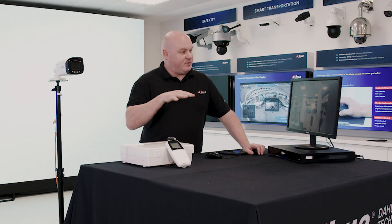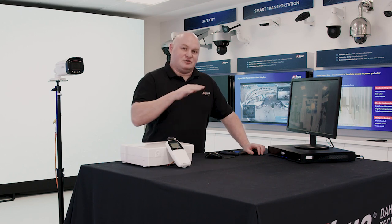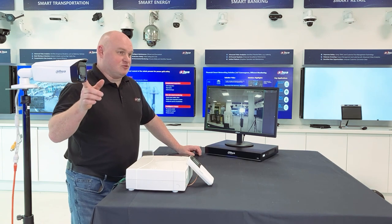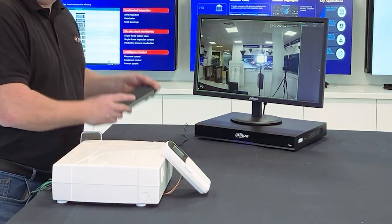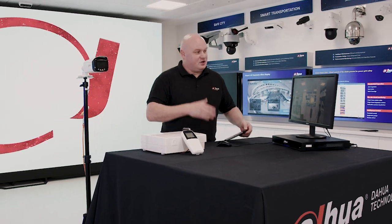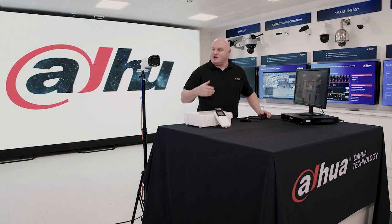Now what I'm going to do is make a quick modification on the Dahua recorder using my alarm outputs. So whenever this alarm goes off, I would actually trigger my Risco. That, of course, will be made aware on a mobile phone. So first of all, just to show the arm and disarm feature in better detail.